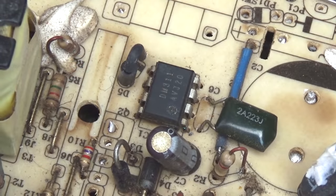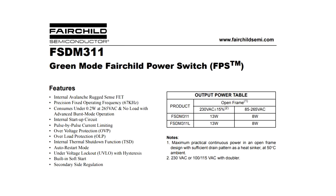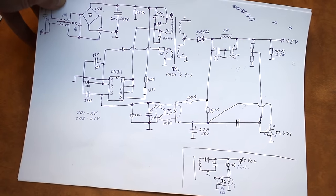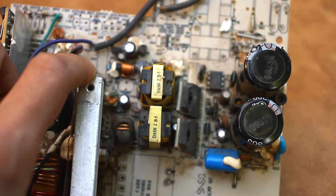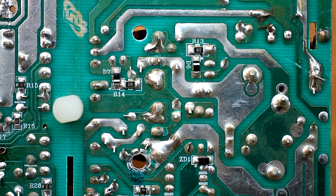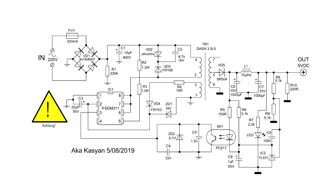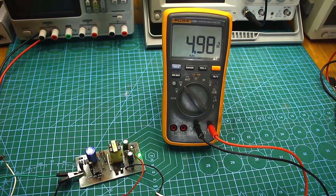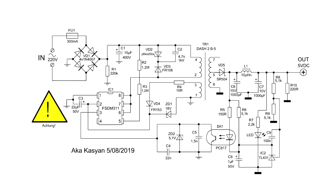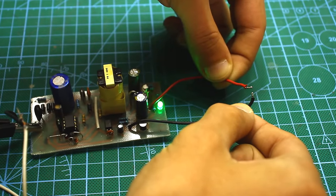The standby mode of such sources is based on just one FSD-M311 chip. We can find technical documentation for this chip. I partially redrawed the circuit of the power source, but as it turned out, that was in vain, because complete circuits for such power supplies are available online. I just needed to compare them with the circuit I had and fill in anything missing. This power supply is a single-cycle design and provides high stabilization of the output voltage through the use of a precision TL431 reference voltage source. Due to a connected resistive divider, this microcircuit sets the output voltage. The power supply also has short-circuit protection and soft start — it is a very good power source.